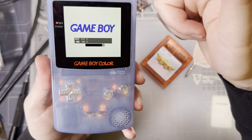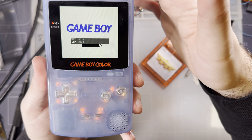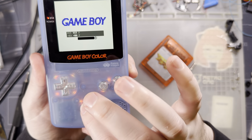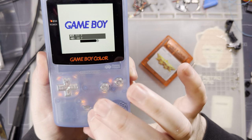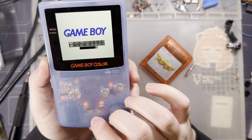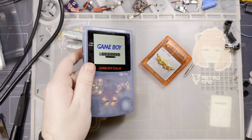The last option on the first page is N — which means Next Page. On page two there are two options: XST and YST. As I toggle through them, the display area moves up or down on the LCD. I'll leave these on the default since the display was already perfectly centered. So in case you need to reposition the display area on the LCD itself, those settings are here. Pressing P likely brings us to the last page.